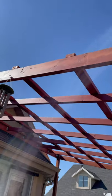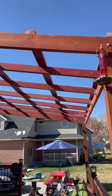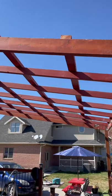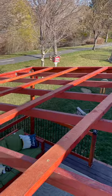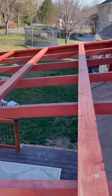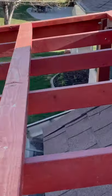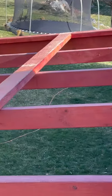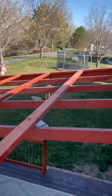I'm going to fill in the spaces that are open there and put some wood in between to keep wind from going in and ripping off my roofing. I put those little filler pieces in — see here, here, here — so that the wind can't catch up underneath on the sides.